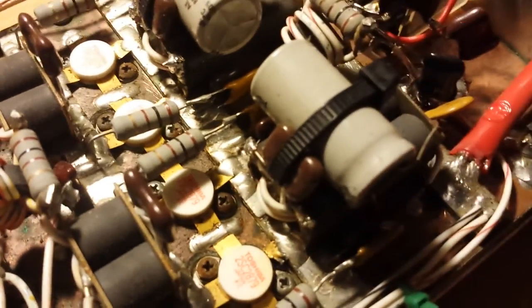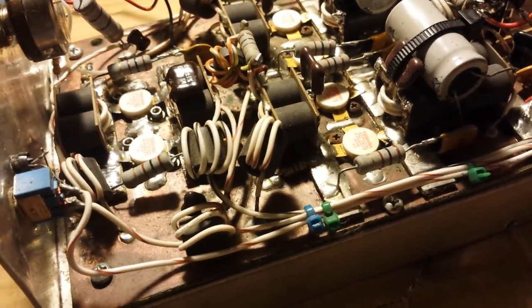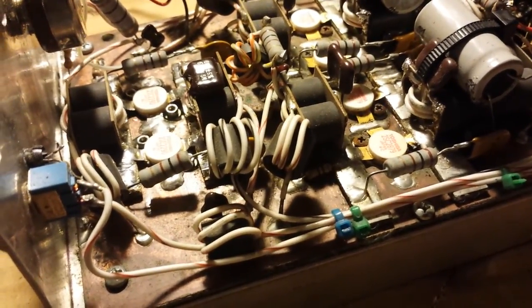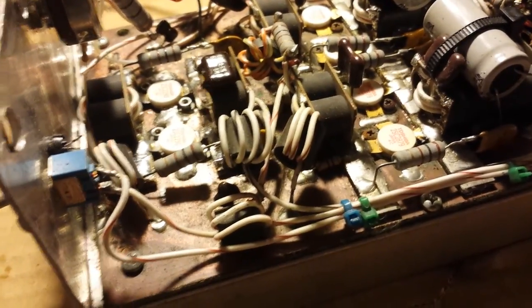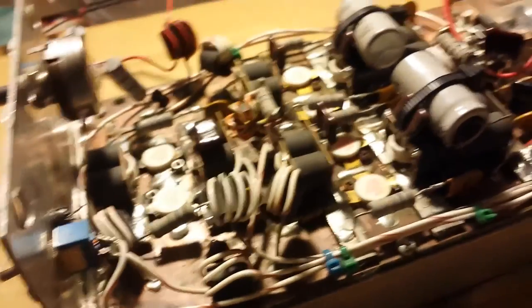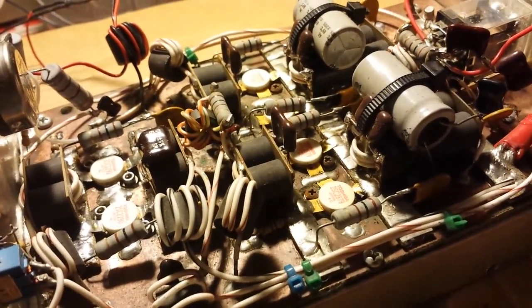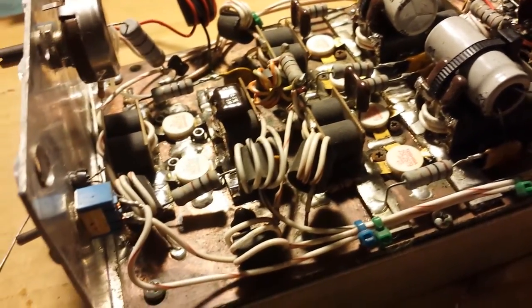It is working now, so solid counts. Don't have a massive kilowatt box or nothing. Put it on a good solid maybe 15 volts, hit it with a good decent radio, and you should be able to keep it rolling about 800 watts. I can't promise you that you'll be able to get a kilowatt out of this — it's just because of the design. Maybe the fella designed it to be a lower wattage type setup, so maybe the transistors will last longer. It's not a design that I go with myself — it's kind of more like a Motorola type design, with the 680s and the high wrap on the transformers and everything.